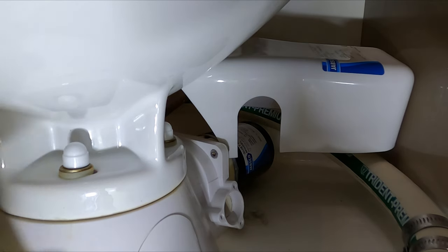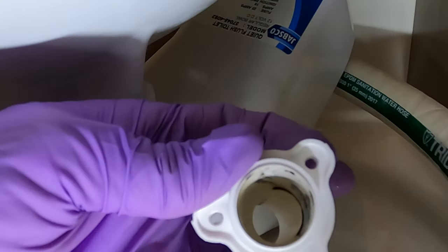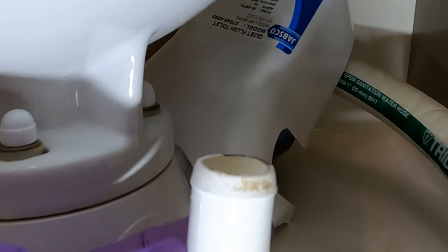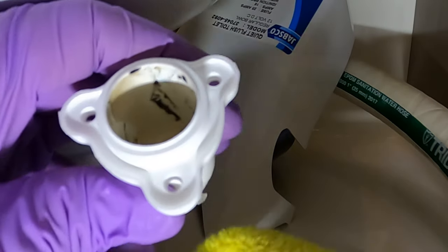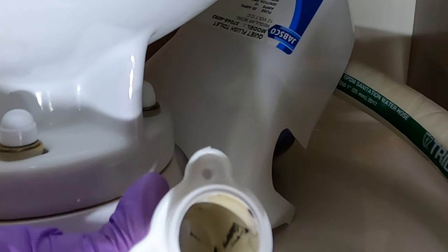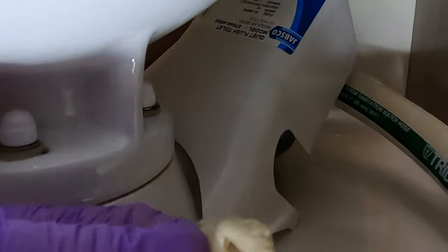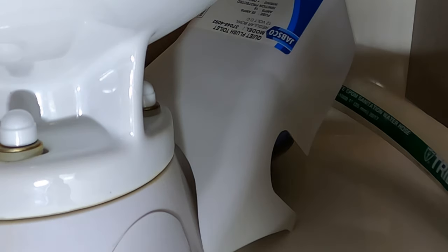Let me go ahead and clean back here — there's some hair. Not my hair. Somebody else's hair. Probably the same species, but we're not even sure of that. Looking inside here, there's obviously some black schmutz — it's a toilet, right? But what I'm not seeing is a ton of scaling. What I've heard is that the uric acid from waste will actually form these crusties — calcium deposits everywhere. They're yellow crystals and they lock up all of these systems — can screw up your macerator, screw up your joker valves, and plate the inside of these tubes. I just pulled this out of the center of that tube — that's more silicone. I'm not sure what that was supposed to do, so we're going to throw that out.